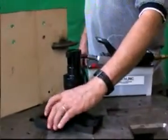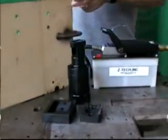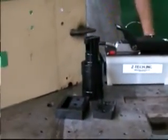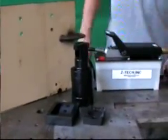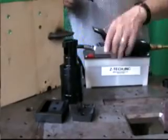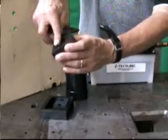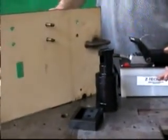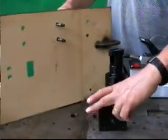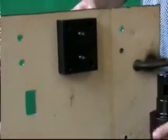Okay, the next method we're going to use with our Dandy die series here is we have a CYL 205A cylinder. Notice we have a lot larger format Dandy die. We've now moved up to 14 gauge steel, and basically the operation by now should look really familiar to you. You basically start with your punch. We insert our draw bolts into the punch and place those bolts through our bolt pattern in our panel. Place our base over that side of the panel.